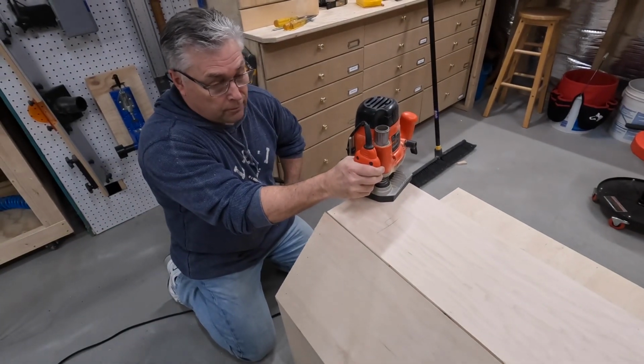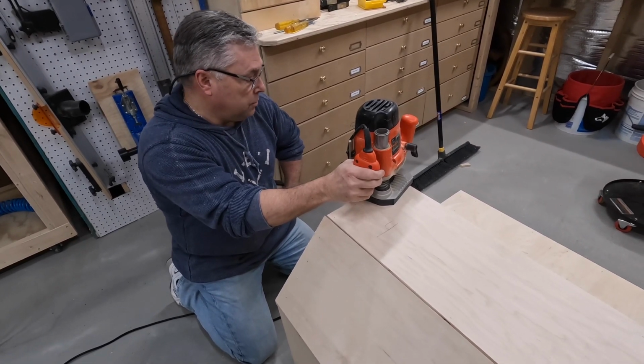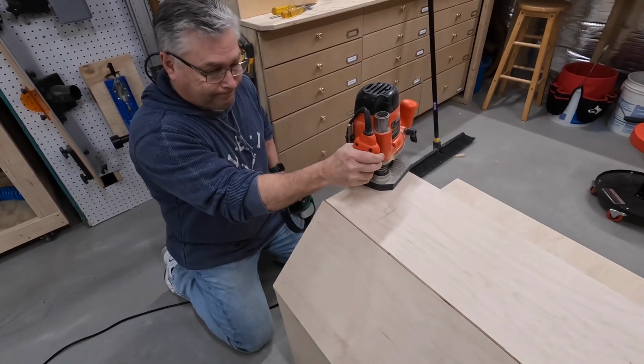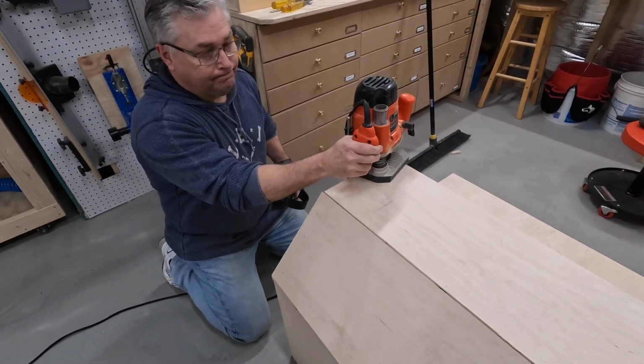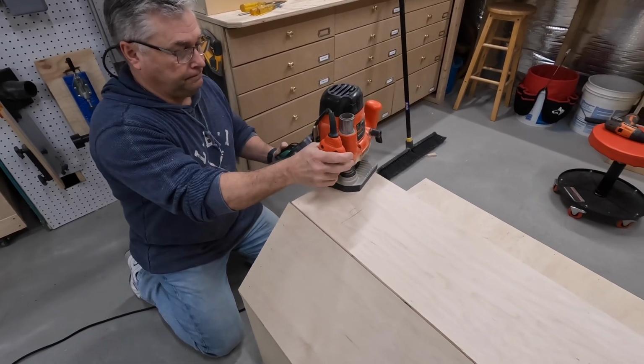We're going to put the round over on everything. I've got a 3/8 round over bit in the router. So basically we're just going to take a router and put some radiuses on every corner on this console. Soften it up because we don't want any sharp edges. Correct. So let's go ahead and rip one and see what we got. All right, very good.